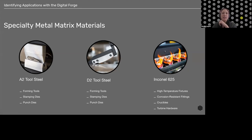Finally, Inconel 625 is a nickel-chromium-based superalloy — super resistant to corrosion and very strong at very high temperatures, higher than H13 can achieve. This allows us to create functional prototypes for high-heat and highly corrosive environments, or tools and end-use parts for those environments. Inconel 625 meets chemical requirements of ASTM B443 and maintains an ultimate tensile strength of 500 MPa at 600 degrees Celsius.